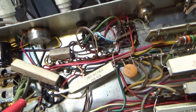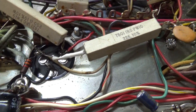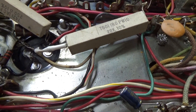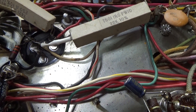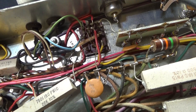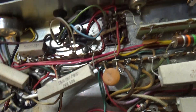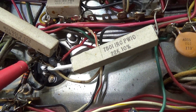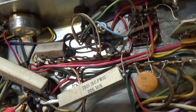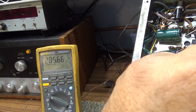Then it goes through this resistor — I believe that's the 59-ohm resistor. On the other side of it I should have about the same: 387 unkeyed, 310 keyed down. Then there's a little 1k 2-watt resistor underneath. I moved this when I recapped it with a different style can cap, so yours might not be in that exact place — I think it's normally over here.